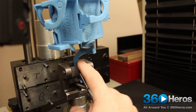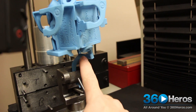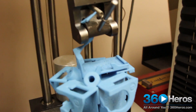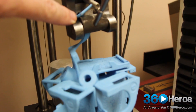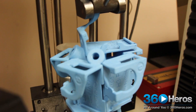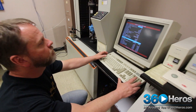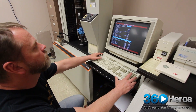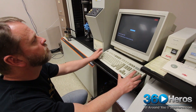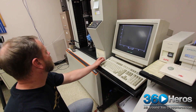We're going to use the very end connectors here, so they're connecting to the flat part. That way you can see the full strength of how strong this is around to this edge, and then same for here up on top. What we've done is we've connected to the top part of the piece and pinched it off so that we can actually see how strong this area is here, because this is where the camera is always constantly going in and out of the holder. So the next step is Matt is actually programming the Instron machine to the proper settings, and we're going to set it up so that it's working on a pull-tear configuration.